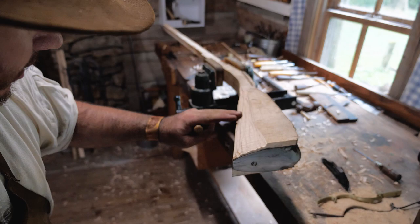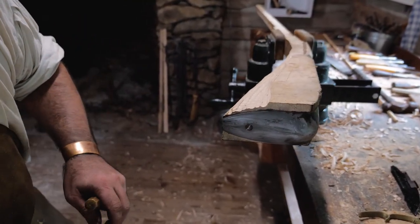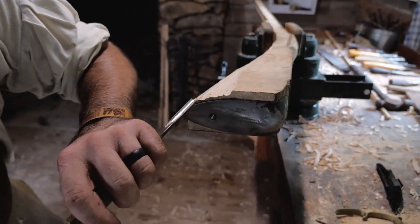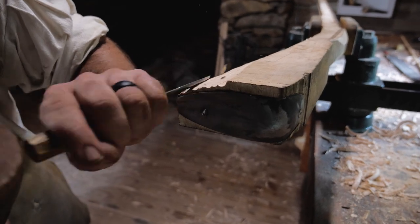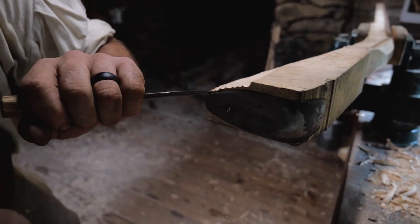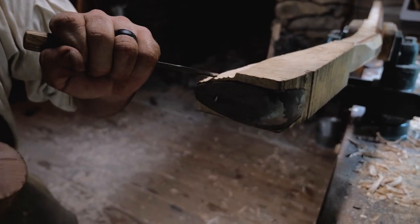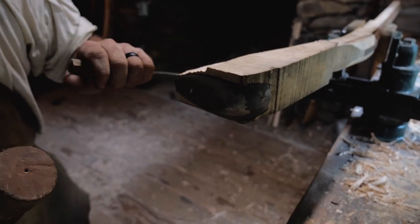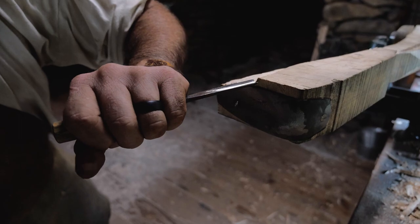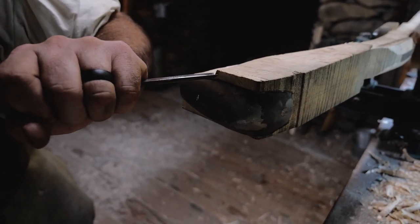When you're cutting these, cutting the stock down, I like to leave about 1/8 inch above the butt plate as I go, and that just gives me a little extra room for carving. Most carvings in the 18th century were very, very shallow. A lot of them, they would actually get the stock down to finish and then relieve the wood around their carving and just feather it back out to where it all looks like it's 3D, but it's actually the same height as it is about 2 inches away from the carving.